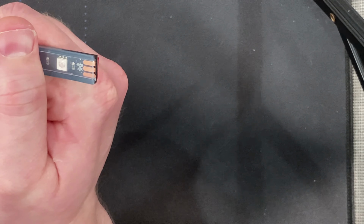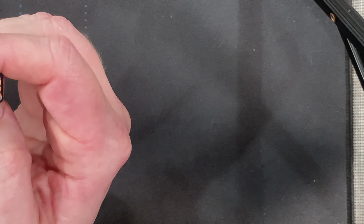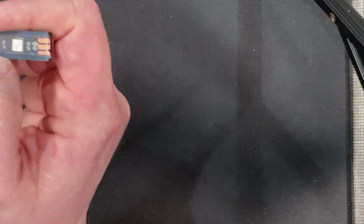It's worth mentioning as well, the quality of this LED strip is really good. It's in this nice plastic protective sheath, which is really nice to see. And it also has high quality 3M VHB tape on the back. So that is going to stick really, really well to the back of your TV, and it'll actually be difficult to get that off. VHB tape is notoriously difficult to unstick when it's stuck down properly. Being that I have a feeling these are a WS2812 driver or something similar, it may not be 2812s, but it'll certainly be something similar. It'll be interesting at some point to try wiring this offcut up to WLED and seeing if we can actually get light out of it.